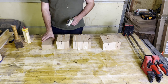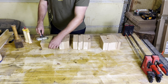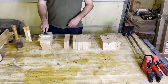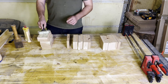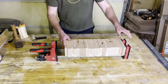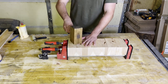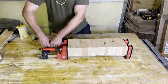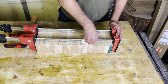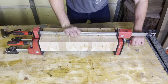Anyways, here's the glue-up. I've got three sections here, just gluing up these panels. To save time I'm putting them all in the clamps at the same time — applying glue where it's needed, and not applying glue in between the blocks. Make sure everything is as even and as flush as possible, wipe any excess glue off, and we'll let that sit overnight.